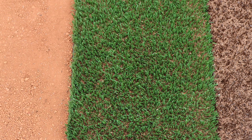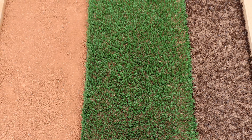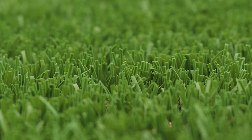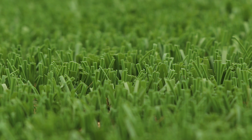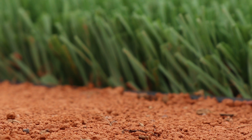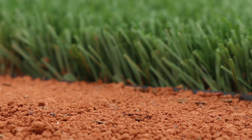The first thing we'll do is build the clay areas. We'll bring in the clay, build those areas up, and get them very close to being finished. Then we'll start on the synthetic portion, which will involve bringing in a shock pad as an underlayment. This turf comes in 15-foot rolls — we'll roll that out, lay it down, seam those panels together, trim them, and get them perfect around the clay areas. The transition between the clay and turf is going to be really critical on this field.